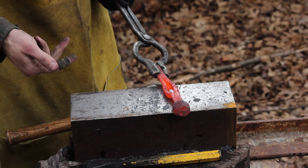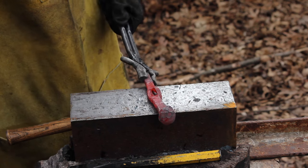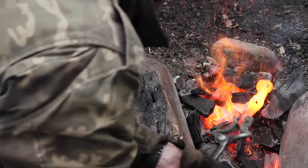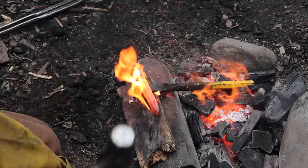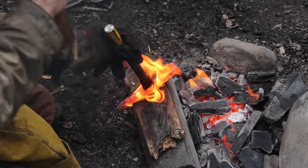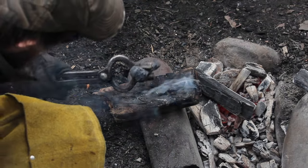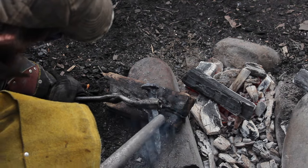I drifted it from the bottom, but with the tomahawk I really need it to be widest at the top so the handle can go on the right way. We'll drift in from this side. The tomahawk mandrel fits in the eye here, which is good. What I think I might do right now is start on the head first and then come back to this.